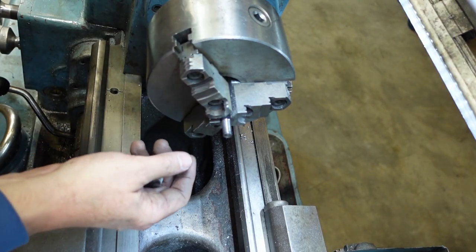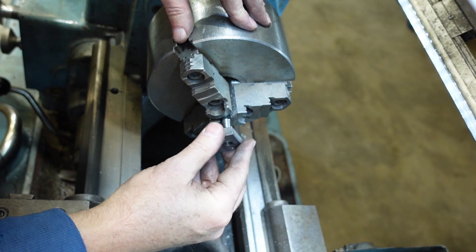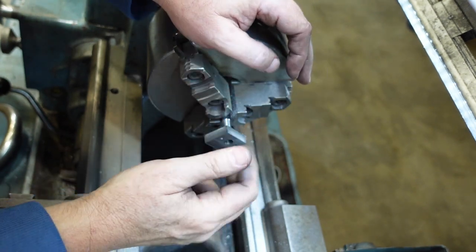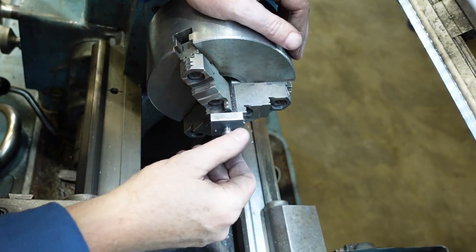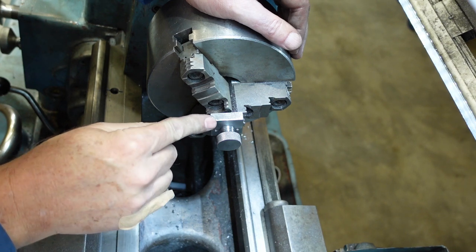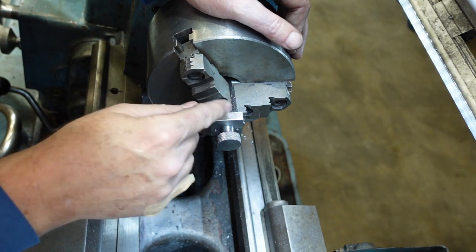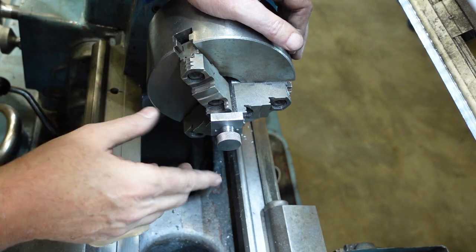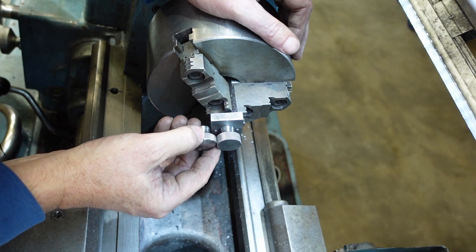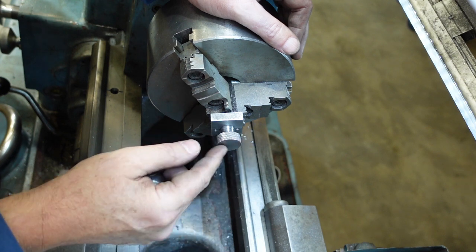What I've done is I've made up the stalk that pulls the two together with an extra long thread. What I'm going to do is spin on the clamping plate, which because it's threaded will act like a nut. And then we're going to spin the knob on, and that will work against that surface rather than bottom out on the thread, which I think should give me a better result. For those people worried about the sharp corners here in this whizzing around - yes, I'm concerned about that and I'll be watching that. But remember too that this chuck has got some sharp corners that are whizzing around anyway, so in reality it's not going to make much difference. I need to use the file, and may start with a lathe tool just to bring that down and take off maybe two millimetres off that diameter to dome it.